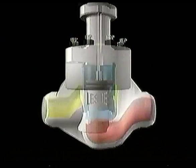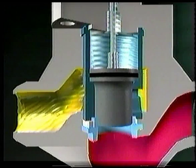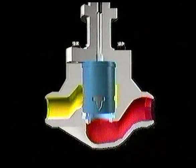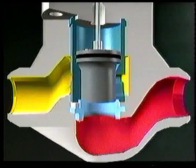Finally, the T2 Pilot allows fluid pressure to provide shut-off thrust with high seat loading. The result is zero leakage at rated line pressure and temperature. The Pilot trim consists of three areas of pressure distribution and two areas of fluid flow movement.